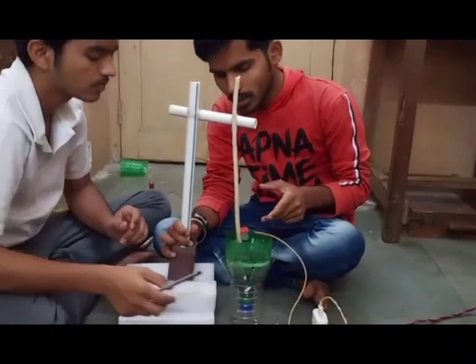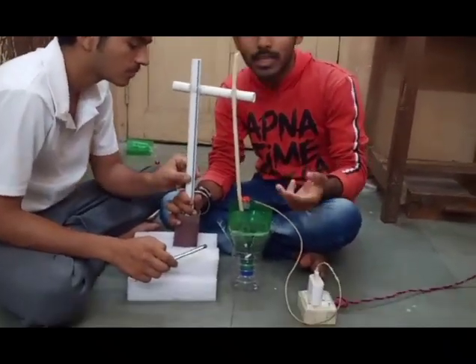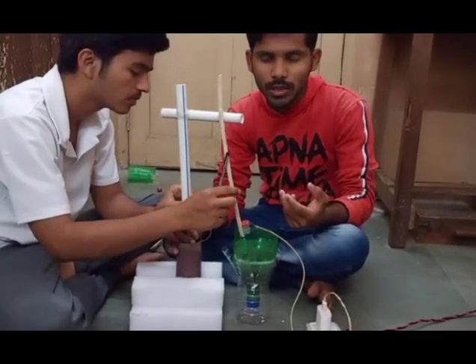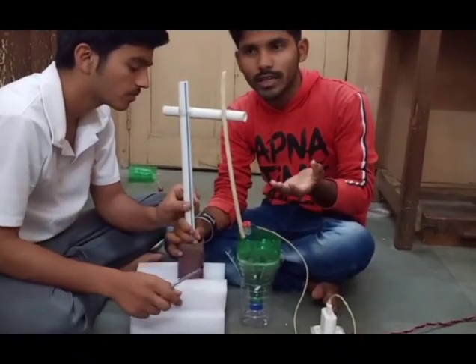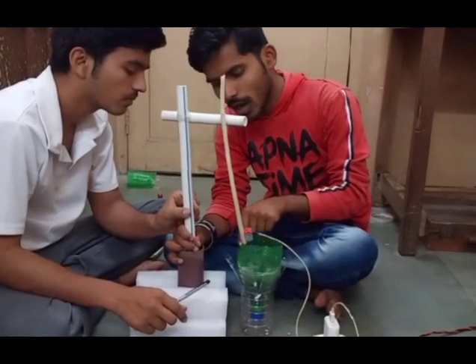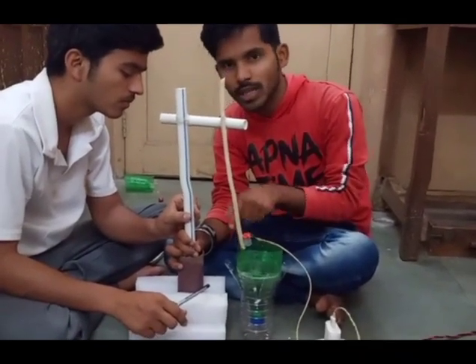In this experiment, when the motor gets started, it will rotate and the detergent powder will mix in the water. It will form bubbles. After forming the bubbles, they will get collected on the upper surface of the water. We are providing here a cone arrangement so that we are separating the froth.